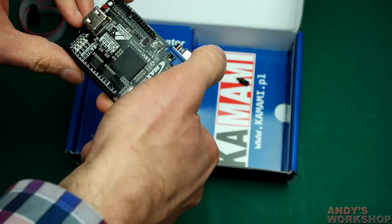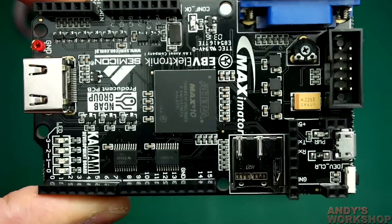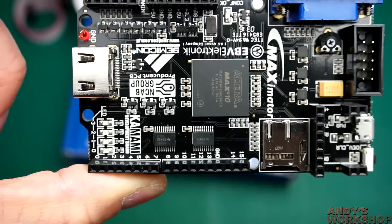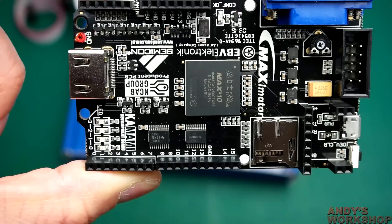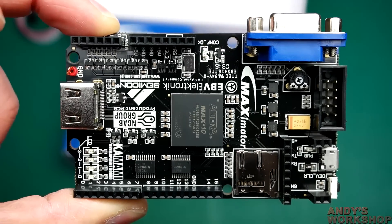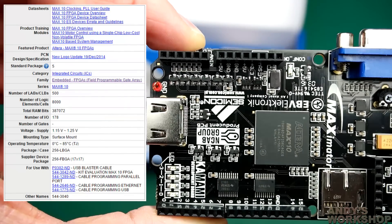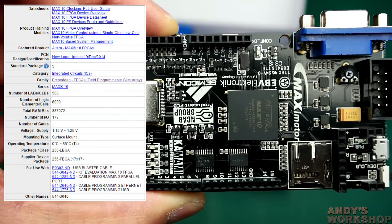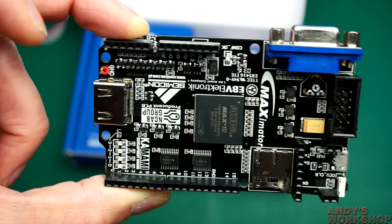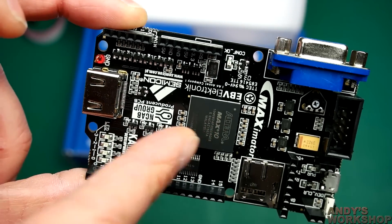And here's the board itself. This is the Arduino format, definitely. Pride of place in the middle is the Max10 in BGA format. There are a lot of IOs on this — it's common in FPGA land to provide QFN or BGA packages because FPGAs have huge numbers of outputs. This particular chip costs around £20 in the UK just for the chip alone, so this board being priced at €49 for international sales is very good value.